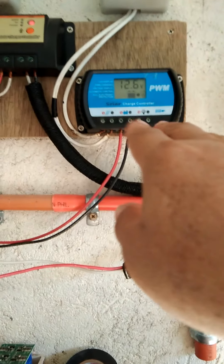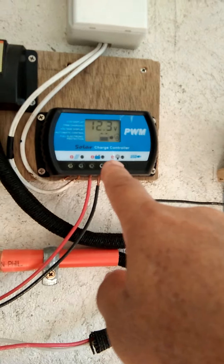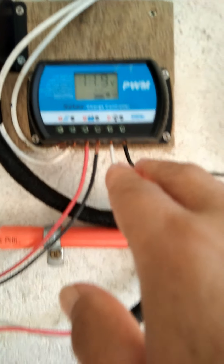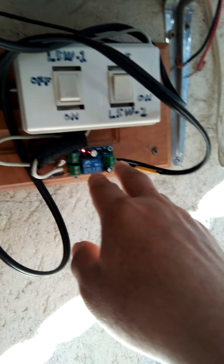The voltage is increasing — now I have moved the solar panel already, so it is a remnant voltage showing here, 12.3 volts coming down, because there is still a load. The remnant voltage is now going down: 11.9 volts showing, 11.7 volts. The ATS is through the DC source, which is supercapacitor number 2.